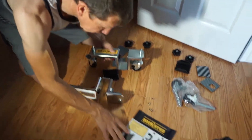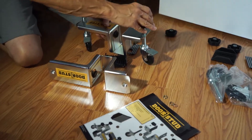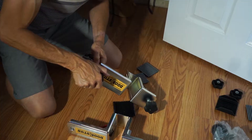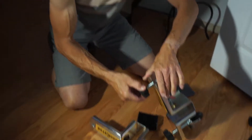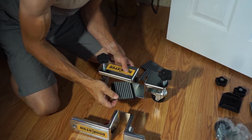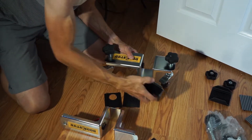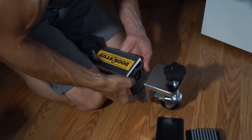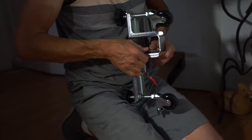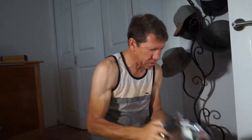So there's that. Looking here, we've got the stop block and the handles — the lock washer goes on. I didn't bring a wrench in, probably need to get a wrench to tighten these down solid, because this is what levels it off. This gives you the level for your door. It looks like we have different spacer sizes as well. The best move is to pull that down — don't do it while it's up because you're going to catch on it, as you can see I did.